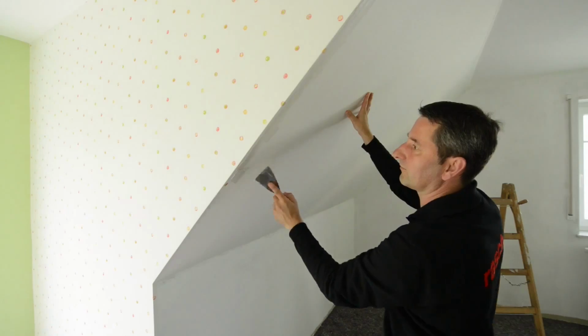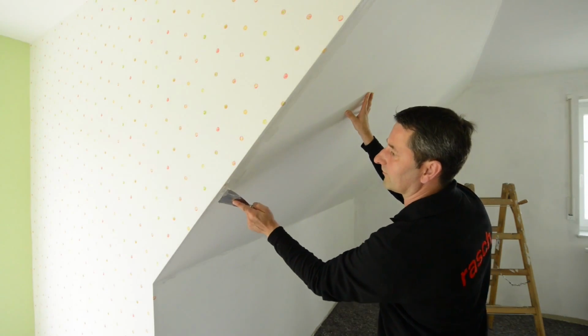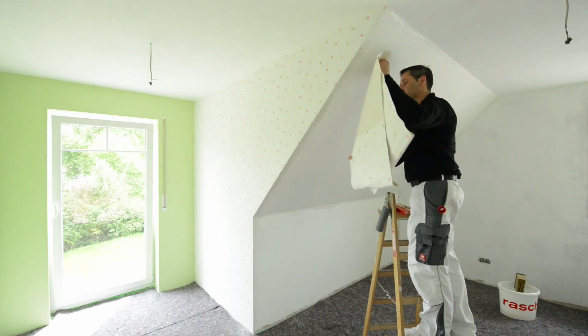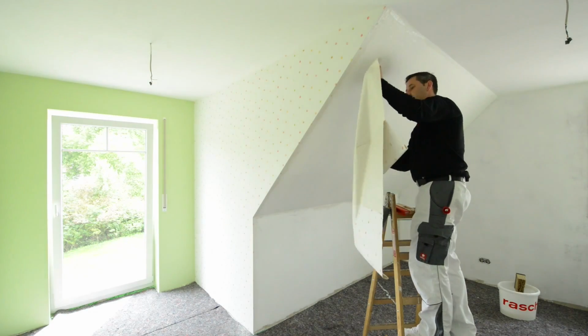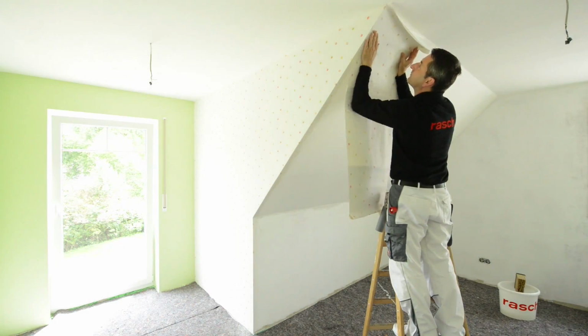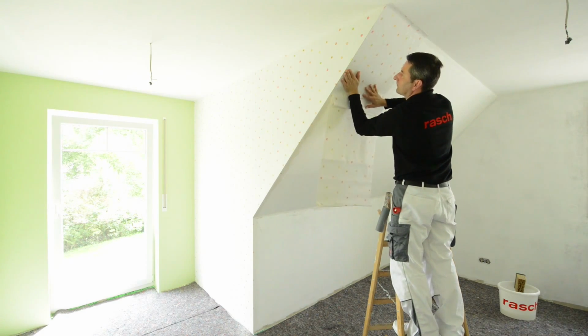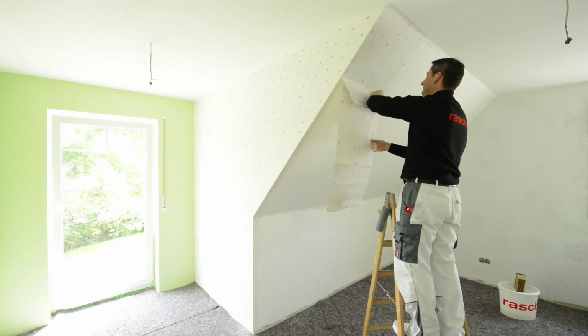We have already papered the side wall of the ceiling slope. We thinly apply plaster, which contains filler, to the intersecting edge of the folded paper in order to facilitate an even intersection and to ensure the paper sticks fast. Having adhered exactly to the soak time for the paper, we can now begin to paper. Again, we lay the paper gently on the ceiling with a slight overhang and paper as far as the mitre.